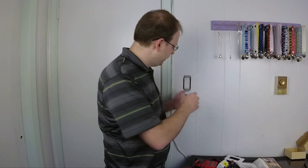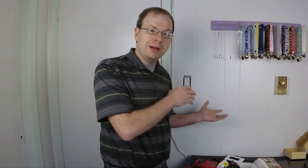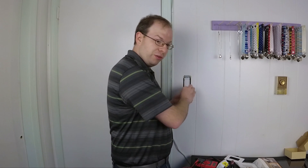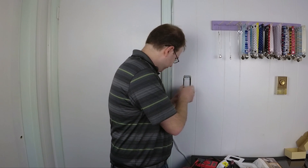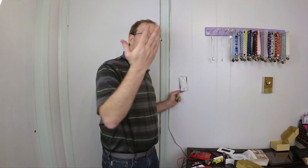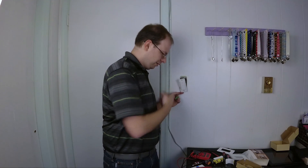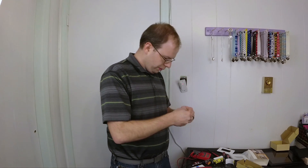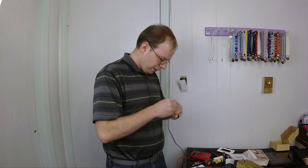One thing I did before I switched the breaker off — I figured out which wire is my hot coming in from the panel and which is the load going to the ceiling. So make sure you figure that out before you turn the breaker off. All right, so we've got the breaker back on, let's test it — turns the light on, turns it off. Let's grab our mounting screws and tidy this all up. Now that our smart light switch is installed and operational...